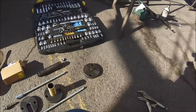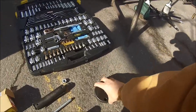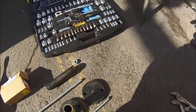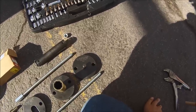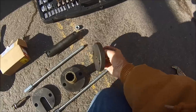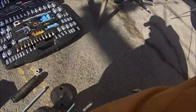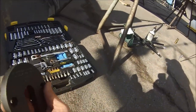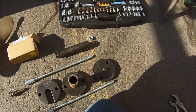When we go to press the new bearing on, we're going to use one more plate — this last one here. This one will also be useful for removing the prop in the future. This year I took the prop off a little bit differently, but next time I'll use the same setup — use this to basically push up against the shaft and this plate to be positioned right behind the prop, then draw the two together to pop the propeller off the propeller shaft.